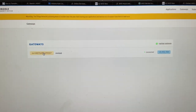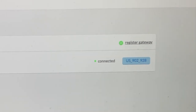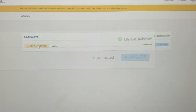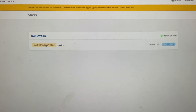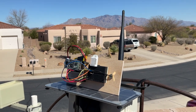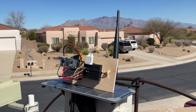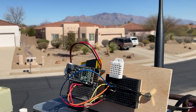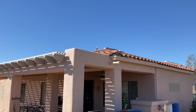Now I'm indoors and I just logged into The Things Network and brought up my gateways — there you can see that it is in fact connected. So what that tells me is that there is Wi-Fi coverage on the side of the house where that gateway is currently being tested. The next thing to do is check that the antenna is working properly, and the only way to do that is to test it with a node. This is my little DHT-22 hooked up to a Feather M0 LoRa, and it's transmitting to the antenna up on top of my roof.